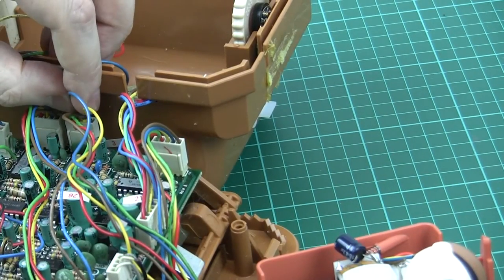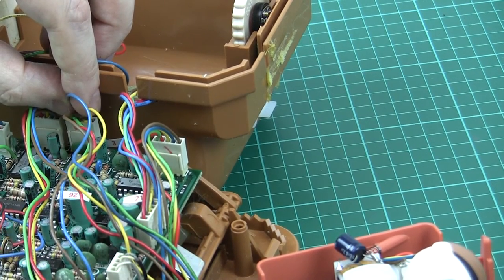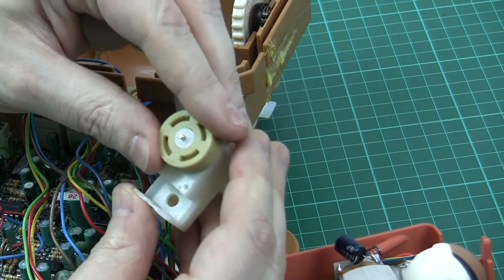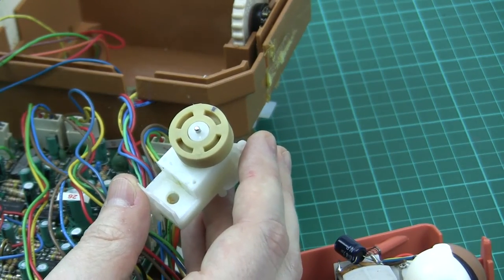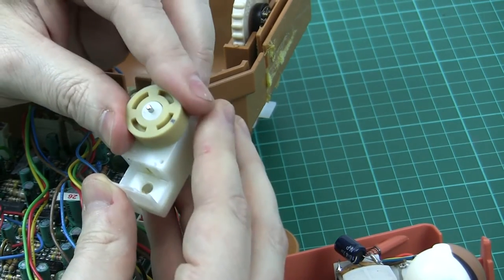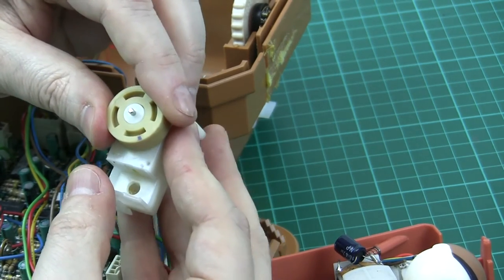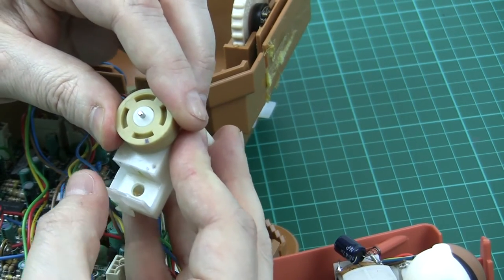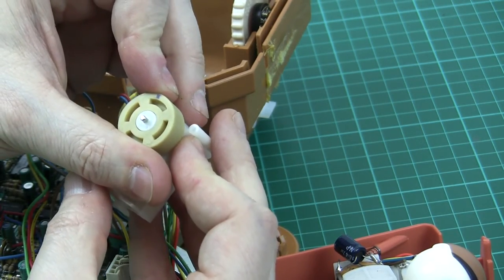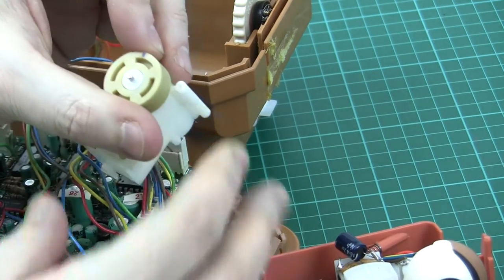So I decided to find another way around this. I'm going to assume that the fault we're seeing — simulated by disconnecting the wire — is the fault we're trying to fix. What I'd electrically like to do is put in something that would fool this circuit, so instead of driving to one end and staying there, it would fool the circuit into thinking it's out of position in the opposite direction, drive the motor itself, and hopefully clear any dirt or debris on those contacts.